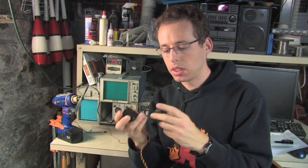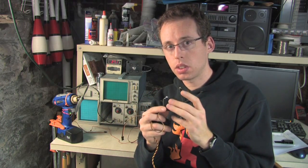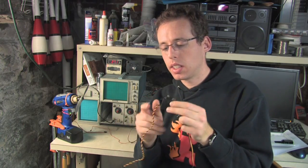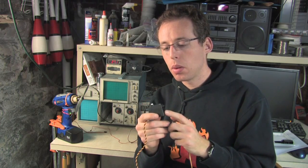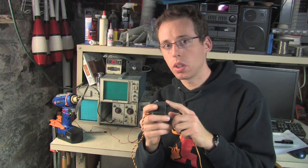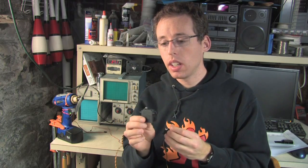On the hobby market today, there are two types of servos: the standard servo and the digital. The standard one receives the desired position data from the receiver 50 times per second and checks its internal state at that same rate. The digital one gets the same data at 50 times per second from the receiver, but internally checks its position data 300 times per second, because there's a microcontroller inside. That microcontroller also enables more complicated control algorithms, like PD or PID, depending on what the manufacturer puts in. In the end, it means it can get to the desired angle faster, provide higher torque at low angle deflection, and is basically better in operation — except it uses slightly more battery and costs more.